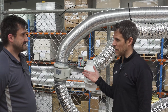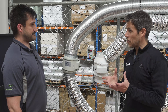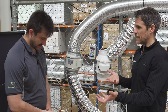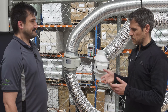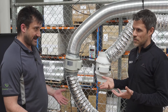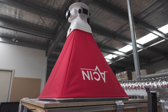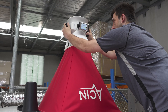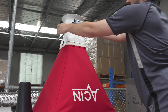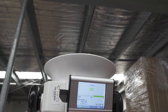And it's not just about power as in electricity — that's not the only thing that matters. It's like for each unit of power, how much do you deliver? What do you get for that? Sometimes fans are sold on the basis of being energy efficient because they use very little power, but you get very little flow — not much bang for your buck. So we're going to test the flow with the flow hood here. That's a very high flow of 120 liters a second.